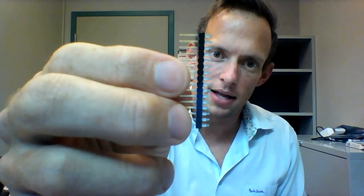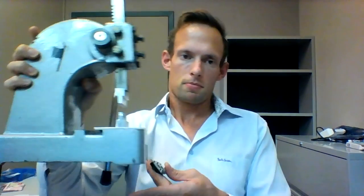In order to press them in, if you notice, the top of these pins have a little teardrop or eyelet shape that's filled with solder. In order to press this in, because you won't be able to do it by hand, you must use this press.